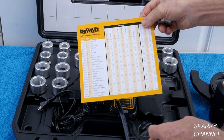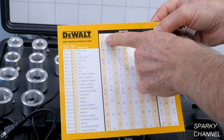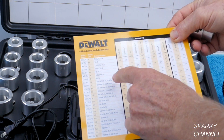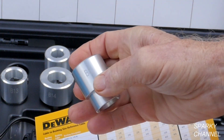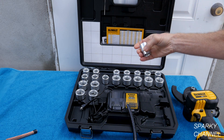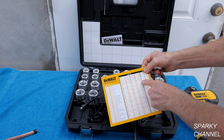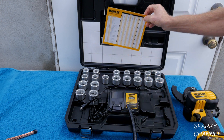There's a reference table right here — you can check to see if Southwire is on the money at 3-0. It is labeled B5 and it's laser etched as B5, so this is the correct one. Sometimes certain brands will have a little thicker insulation, so you have to check this reference table.